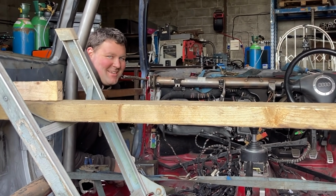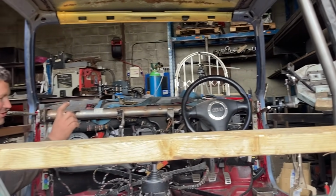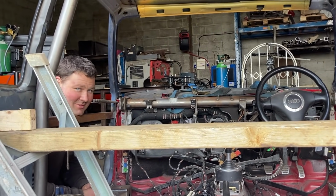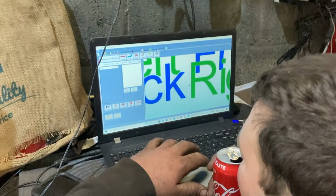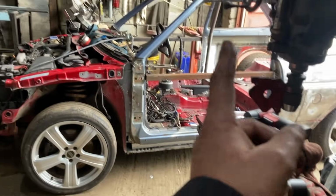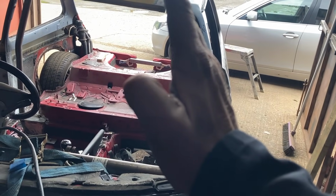It's the door bars that take doing. The door bars? Yeah, because there's a rotation in a door bar, that's where the problem occurs. We'll cross that bridge when we come to it. So we've got the main hoop done, and John's just going to take his time now working the door bars out, because the door bars have got to come up here, then they've got to bend, but then they've got to come off a different angle, and then they've got to bend.